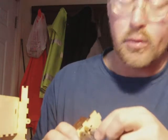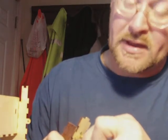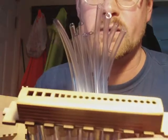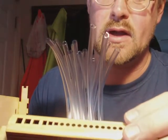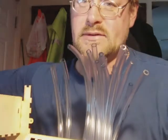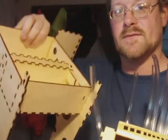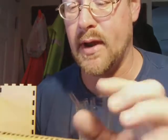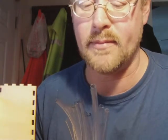This is the brains of the instrument itself — mechanical brains. Actually, the first computers used these. This uses a paper roll that passes over this bar here that you can see. When the openings in the paper come through, this is in a pressurized chamber called a pressure box. The pressure box is actually right here — move it in the camera so you can see it. The pressure goes through the paper when the openings line up with the openings here, and the appropriate pipe speaks.